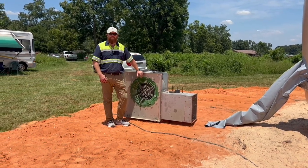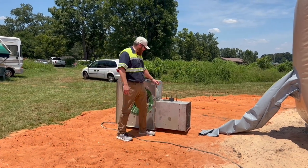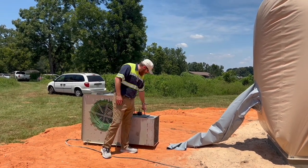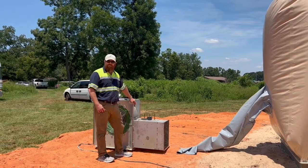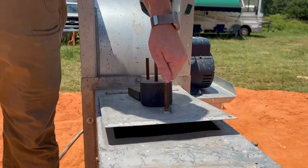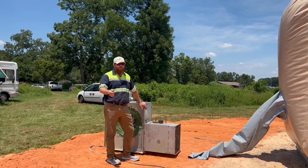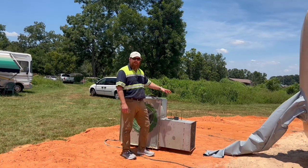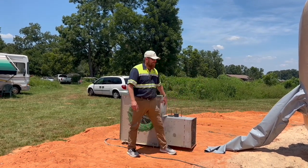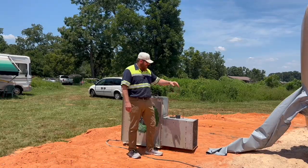This is the SC3 inflator fan that we use on these types of projects. It's a three-horse motor hooked to basically a grain dryer fan. The piece that's custom for our dome building is this front box. It features two main elements that help with dome construction. One is this door with the weights. If I hadn't seen it before, I don't think I'd have believed how effective this is at maintaining the pressure. Once you adjust these weights to close the waste gate and the pressure is where you want it, no matter what you do inside the dome — if you cut an extra hole for ventilation or while you're foaming you're sealing some leaks — this waste gate will automatically open and maintain the pressure. On the inside, you have a couple of louvers so that if for any reason one of our fans does shut off, it doesn't become a liability and have air leaking out. Those louvers will shut and block the air from leaking out.